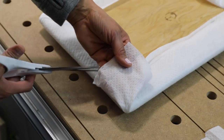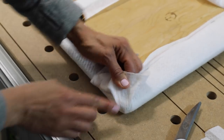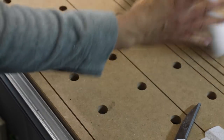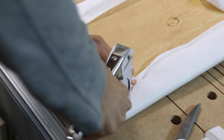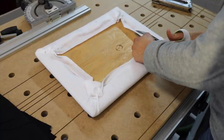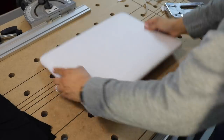Now we've got a pretty tight fit — we just have to secure these corners. I'm going to cut a little triangle of excess fabric out because we don't want bulky corners. Pull tight right in the middle, fold the rest onto itself, flip it over to check the corner — that looks pretty good — then staple with a few staples. Once all corners are stapled, go ahead and trim the excess fabric from the back. Add a couple more staples pulling tight to make sure it's secure.